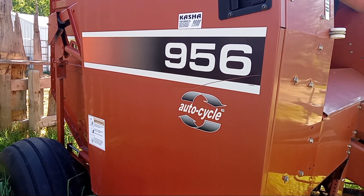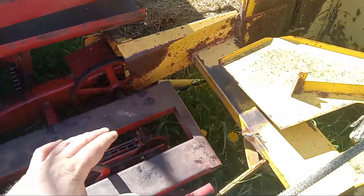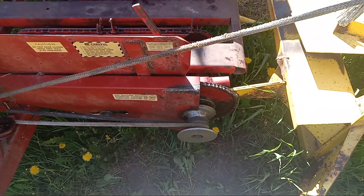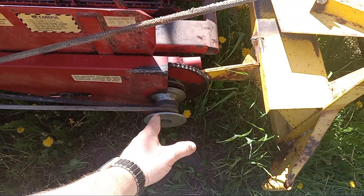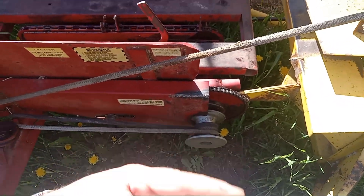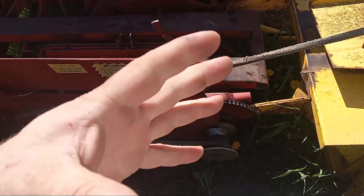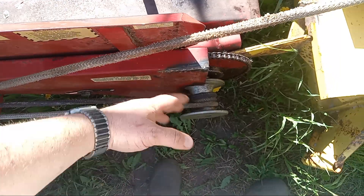This is a horrible, horrible design. New Holland came up with this aluminum hub that is seized onto the shaft. You'd have to cut it either with a grinder or a torch. The problem is when you cut aluminum it almost explodes - it gets trapped in the grinding wheel disc, gets heated up as you're cutting, gets embedded in the abrasive, and it'll actually start popping and cracking like a little firecracker. And if you torch it they just melt.